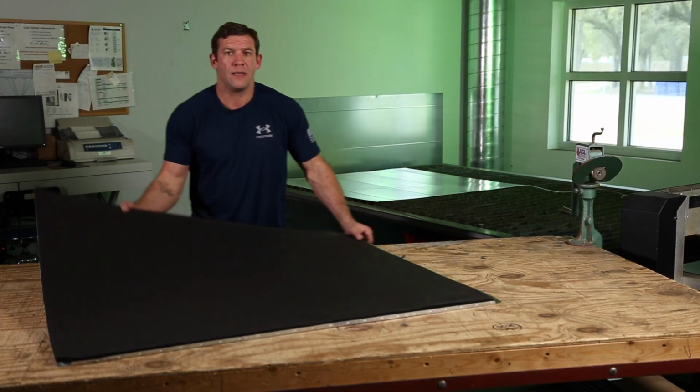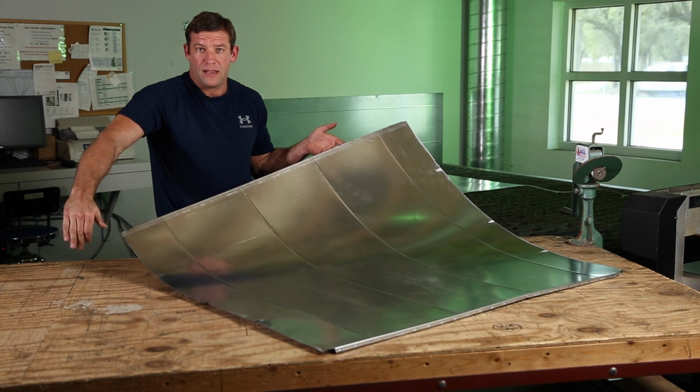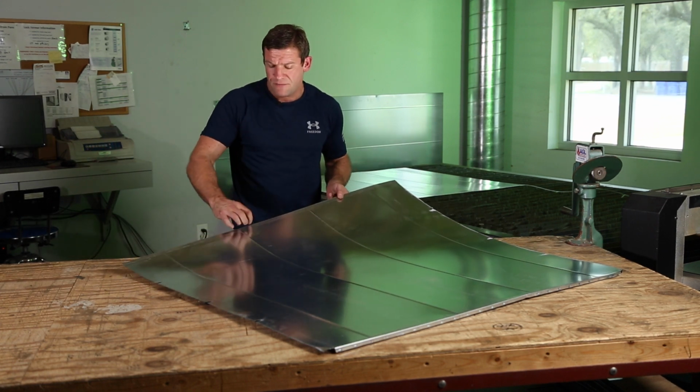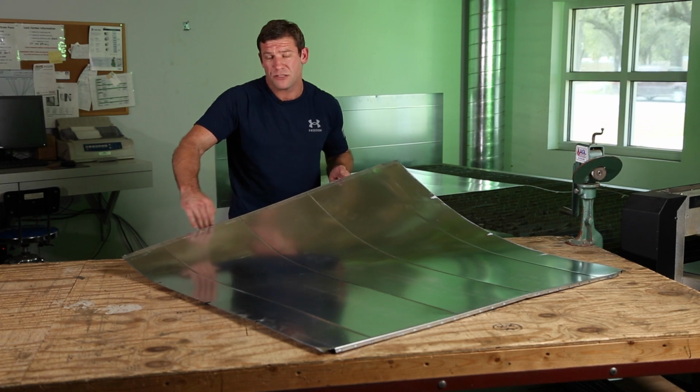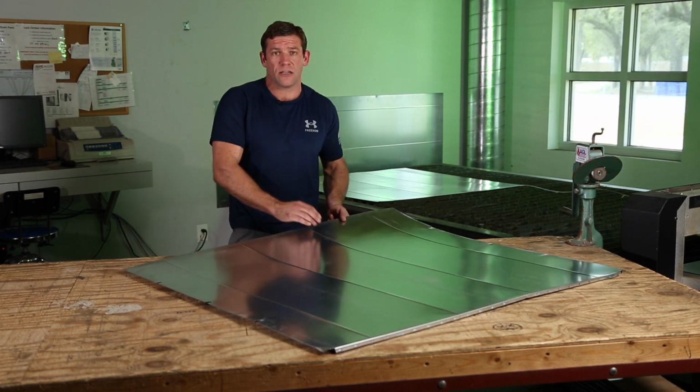So like I said, if you struggle with that seam and getting that lined up at the end, you could always work your way back like this and then flip this material upside down and cut along this female edge. But that's one more step. If you have a short piece, it might cause jagged lines. It's better to just do the other method and get good at it.